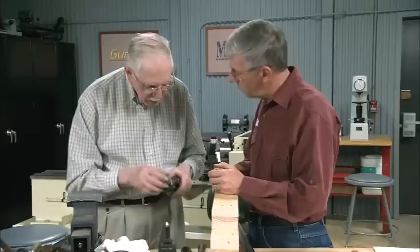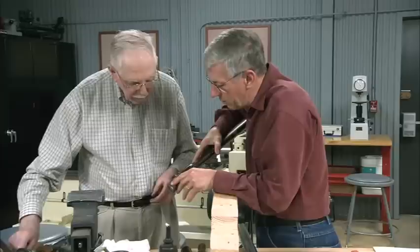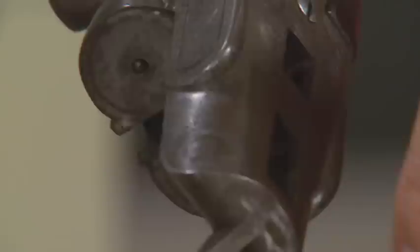Ream it out with a reamer a little bit bigger, and drive in another pin, say 5-7 thou bigger, and then open the hook. Jack, a lot of people may not be able to see what this is. We call it a pin, but it's obviously a non-integral piece that's been drifted in there. That's right. And then they have engraved around it, so it's actually a hidden pin. You can see a round part. But we're going to drift it out of there, and it'll be real apparent when we do.